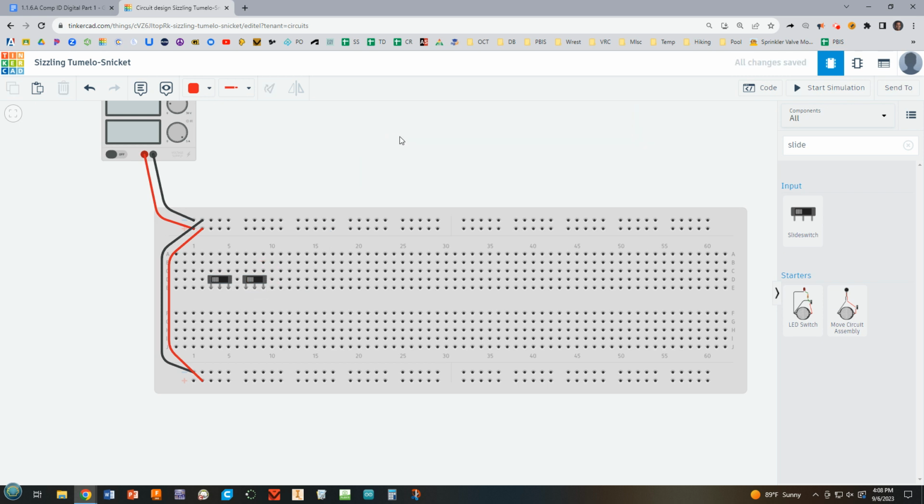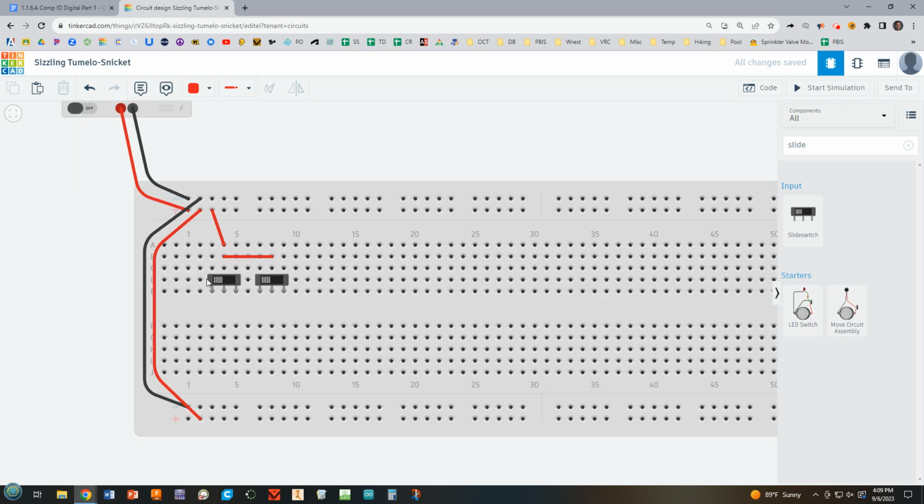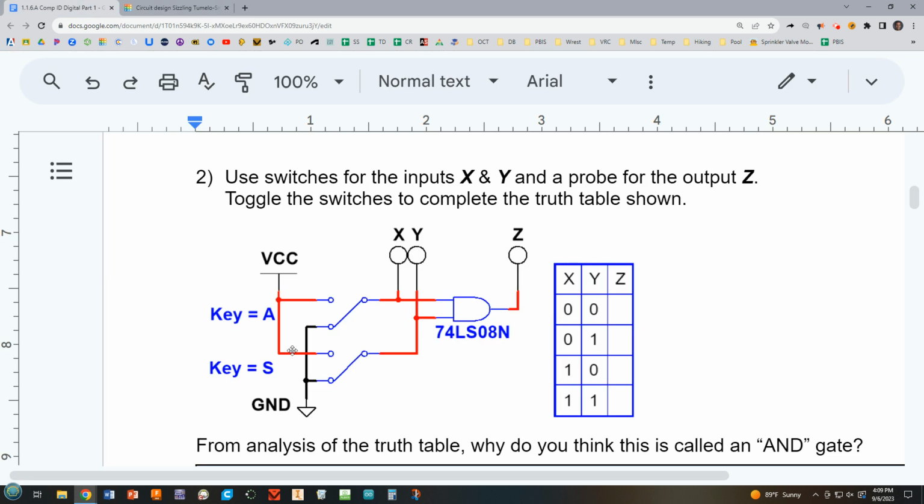All right, now let's run the power into the common. Now there's a couple of ways I can do this. I can run it into here. Now it's connected to the middle, so now my power out is on this side. Okay. I can now hook from the power bar up to the middle here, or I can do this and hook them up that way. Either way works. Okay, because I'm getting power over into the middle here. Now we're not going to ground the other side because we don't need to. We'll talk about that a little bit later. So now I have my 2 switches that are switched, bringing my 5 volts.